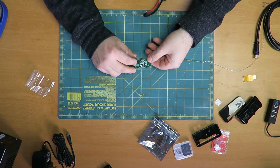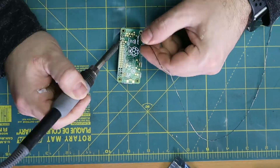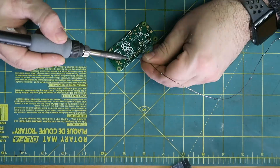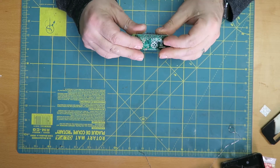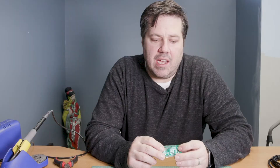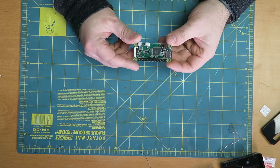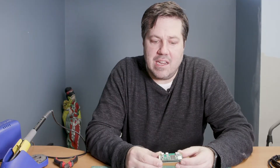I'm going to drop the headers into place, flip this around, and very carefully solder all those pins, making sure none of them short out. I got that all soldered on — the header is now in place. It is tedious, and you do need a fine-point soldering tip. If you're guaranteed you'll need the header, there are kits with the header pre-soldered. But for many people who aren't using every pin or a Pi hat, getting it separately gives flexibility. It took maybe five minutes to solder these in place.